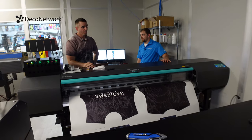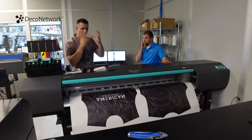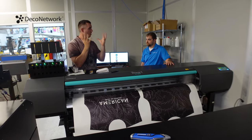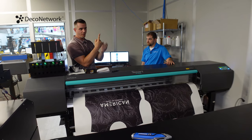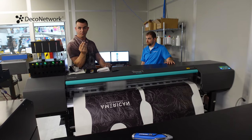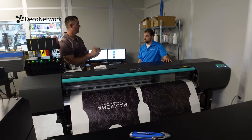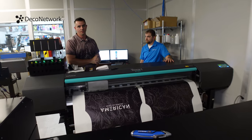Correct, the product. At the molecular level, and to delve into that a little further, what's actually happening, just like the pores in your face, polyester is a smooth fiber. So let's say I'm washing my face and I heat my face up, my pores are opening. We're doing the same to the polyester fabric. We're applying heat, that smooth fiber opens up the pores, and then when the ink is in its gas form, it's going to go into those pores on the fiber and permanently adhere to that. So it'll never peel, chip, crack, fade, or dull. A million plus washes, the garment will fall apart before that ink ever actually leaves the product.